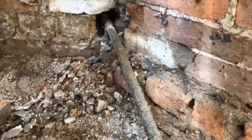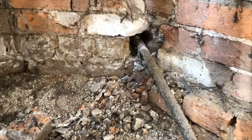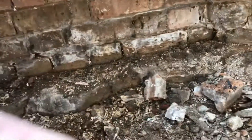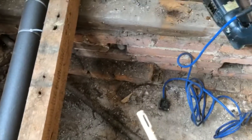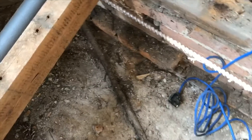You can see the original power cable here for the house, which goes out just below the pavers outside — it's very shallow out there. I want it to be a bit deeper than that, but I've also got to either go through the foundation of the house, which goes beyond the wall, or avoid it and go just above. I'm going to pop a drill through just above the foundation. I can see the foundations here. I've got a metre bit, a 10mm SDS bit, my SDS drill, and a hole saw. We'll crack on and see how we get on.